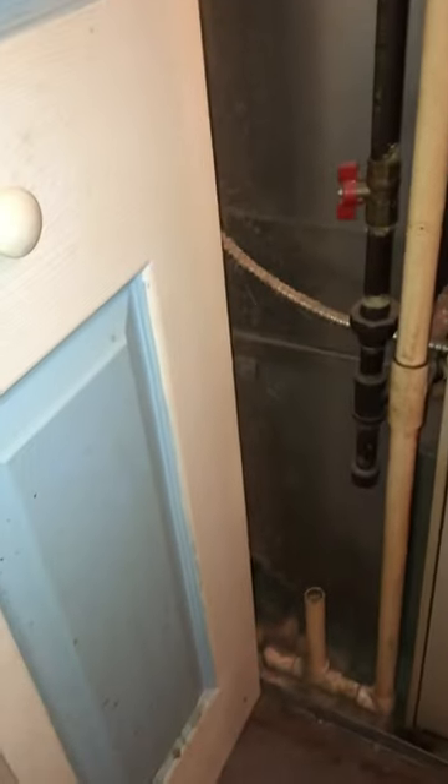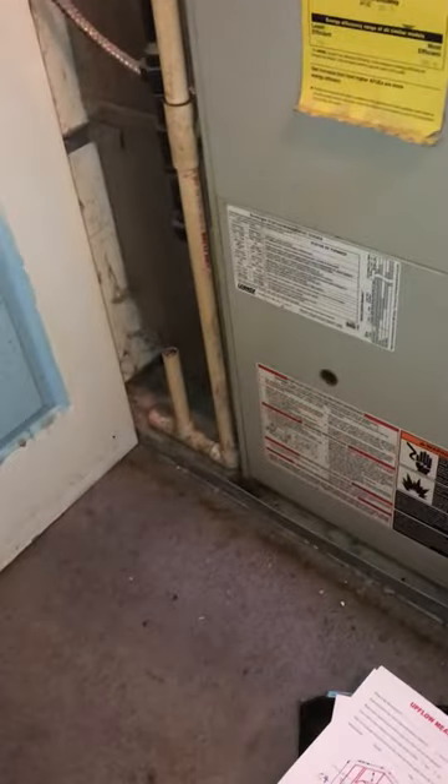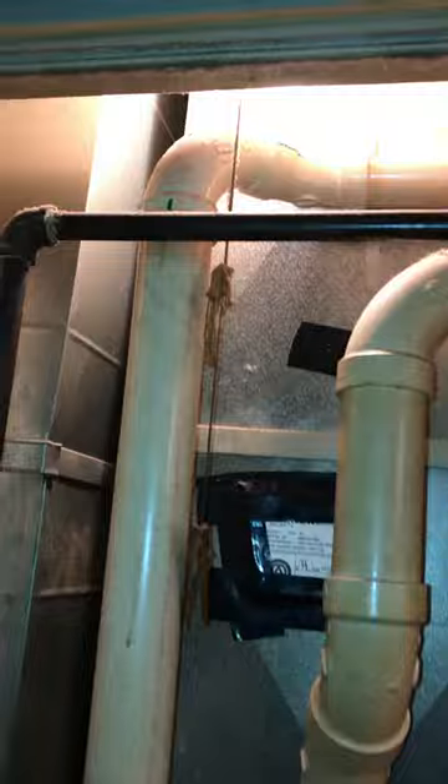Access to get in and out is through the door here. The closet is just adjacent in this hallway. You can see on the drain it's running PVC and it's actually sitting on a pan, so we'll need to measure that pan. The thermostat is close by and it's a newer one, so we'll be keeping that.